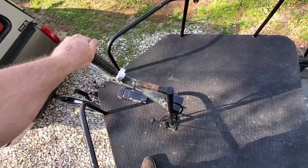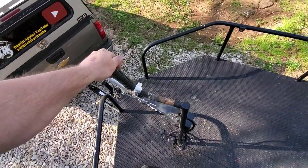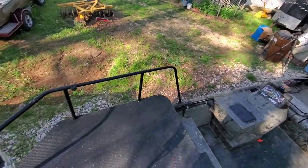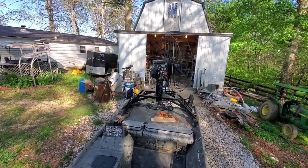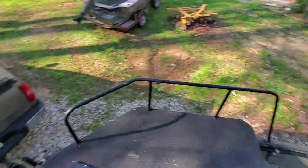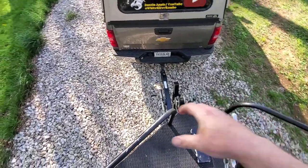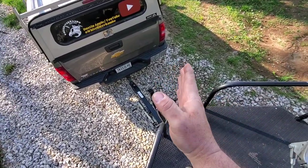Once it's tuned properly, the turnstile will turn in the direction you need. There's straight on — you can see our fan is straight on. If I want to turn the boat this way, it turns the fan this way. You're actually turning the turnstile the opposite way that you would be turning the fan. So if we squeeze our throttle, what that's going to do is take the front of the boat and push it that way. This is a very easy style to drive — anybody can get up here and say there's a stump, I want to go that way, turn it, squeeze the throttle, and it's going to turn the boat as it pushes.